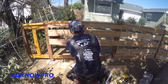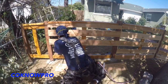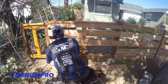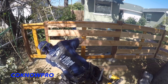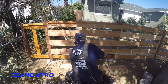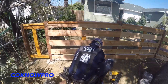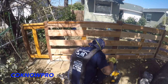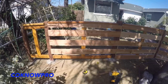And remember, if you're measuring between the gaps and you're realizing that the measurements aren't quite the exact same, that's because sometimes these dog-eared fence planks, when they come from the local hardware store, they're not always the exact same reveal. So one might be an 1/8 inch stronger, or even a 1/4 inch stronger than the other one. So what I always recommend is just try to figure out where your next plank is going to go, and then compensate in between. Or let's say you're going to butt up one plank against the other one, make sure the planks are basically the same size.